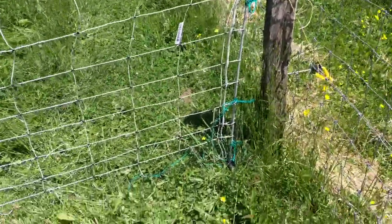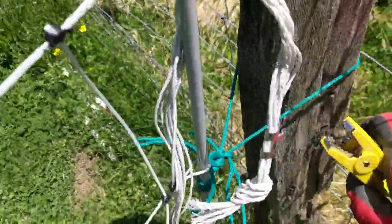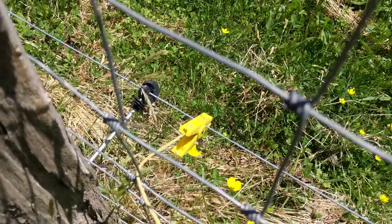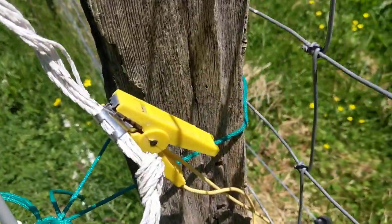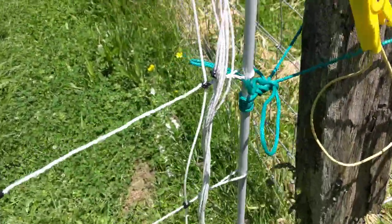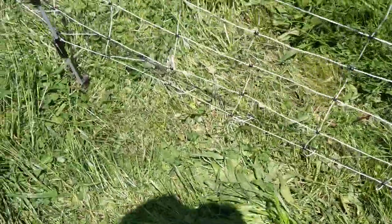When we set up this net fence, we get it close to a post and then hook it to a hot wire down there. This isn't hot right now, but we come up here and hook it to this metal piece — the solid metal connector is what joins all the stuff together. It ends up hooked up real solid, not touching anything. You don't want your fence touching your post or anything metal.